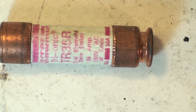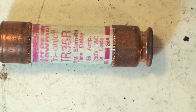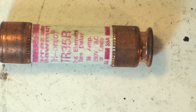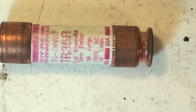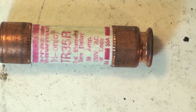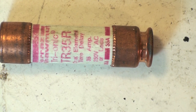I don't really want to say the fuse itself is the problem, because usually if a fuse blows, it blows because something else overdrew it. It could be a bad disconnect — as I've shown before, if the fuse looks a little burned. It could have been a locked-up motor or something like that, in which case it'll blow again. Occasionally fuses will blow as nuisance blows that you never find out why.